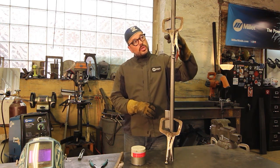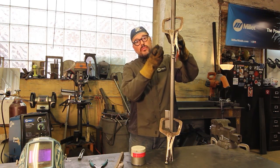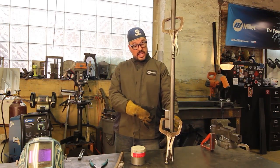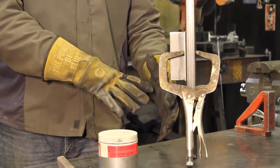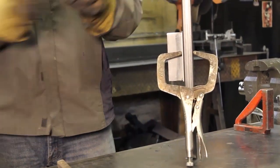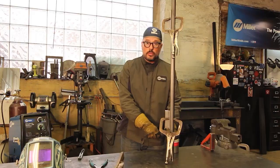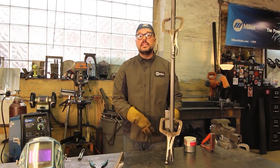You have to be careful because your hand is going to be collapsing, moving the puddle down and carrying the fall of the puddle. If you're below chest level and there's not enough or too much distance to compensate for the drop, you can use anything — set it right there, brace and support, and drop your hand to a terminal point. As soon as you hit that terminal point you stop, move it to the side, clean it off, and start again.